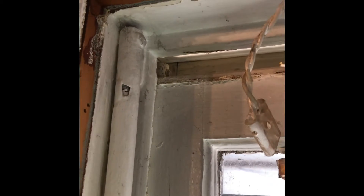Be aware the window is free right now. There's an old alarm wire holding it in right now, but there's nothing really holding it in — maybe a couple of nails from the stops that we're going to have to take out. You want to keep a hand on the window and put a pry bar in each side, little by little pry it out, and then we'll be able to remove the sash. Now's the time to put on your safety glasses if you haven't already, and your gloves. You want to have some sort of work glove on for this too — I've had them snap and hit my hand. Safety protection is definitely recommended.